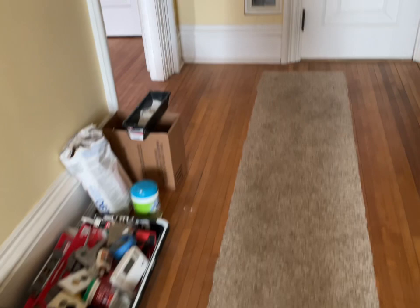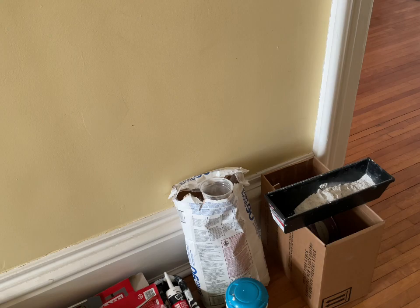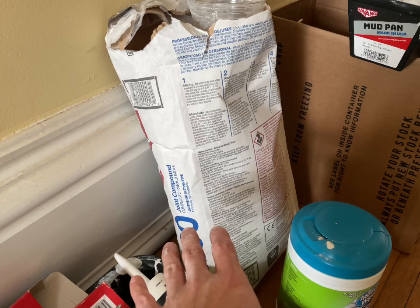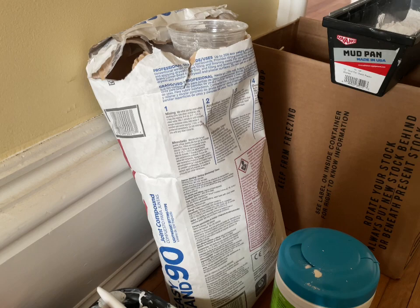Something to point out: as I'm doing renovations and fixing different areas of the house, sometimes I say plastering but I'm actually just using fast-setting joint compound on these little patches because the working time is so much lower. Now if it was something I really need to adhere to the laths — like a complete re-plastering of a wall — I'm going to use real gypsum plaster for that.